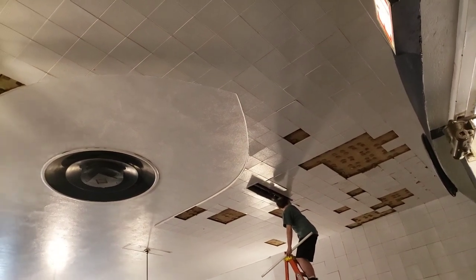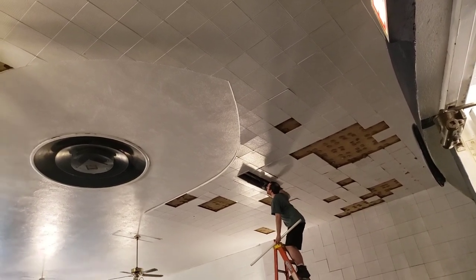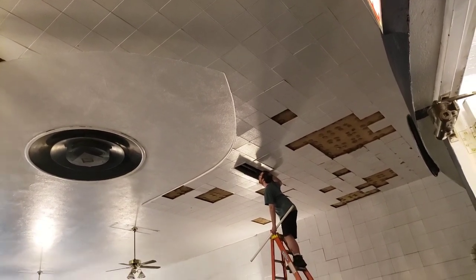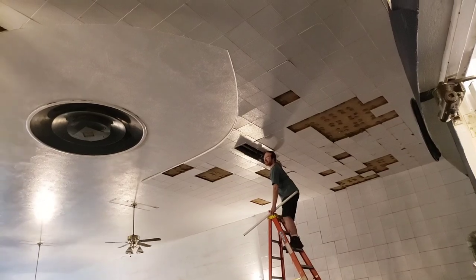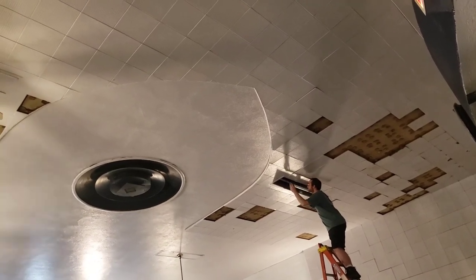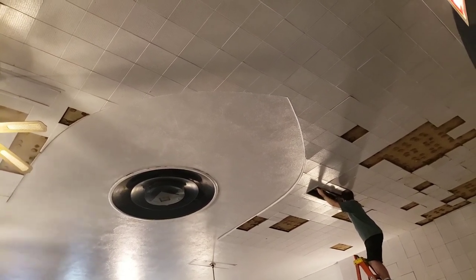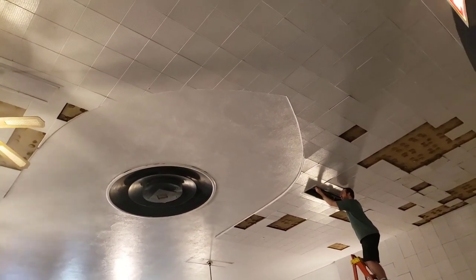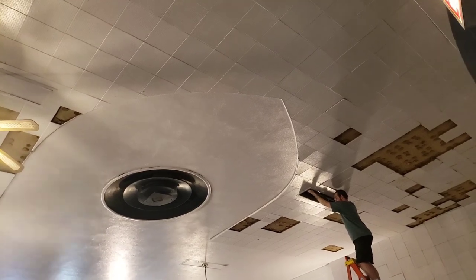But yeah, would it be fair to say those ballasts are about an amp apiece? I can tell you exactly what you're thinking. You have some on the ground. What'd you say? 0.8 amps. So yeah, that's close to an amp apiece. So let's just say an amp apiece, and there's two ballasts for a troffer, and we got 13 of them. So, granted, we're still talking about less than 30 amps, but that's, again, a current draw that this wiring hasn't seen in 30 years.